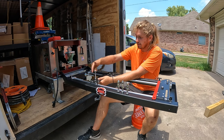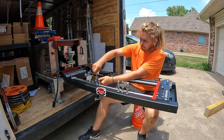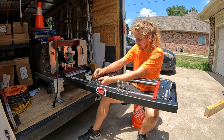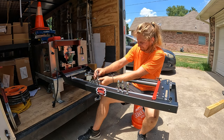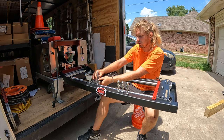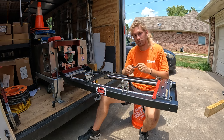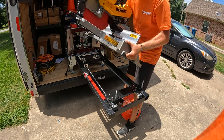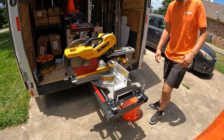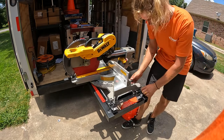Put on your second nut. This nut is used for the miter saw to rest on, kind of as the floor of the miter saw. That one doesn't have to go all the way down. Repeat the process for all four mounting slots. Now that our fine-tuned mounting bolts are in place, we can set our miter saw up on the gutter miter station and align our bolts with the holes on the miter saw.